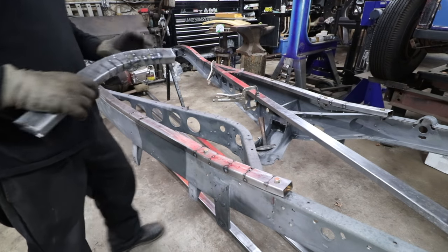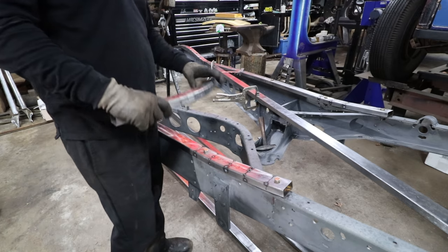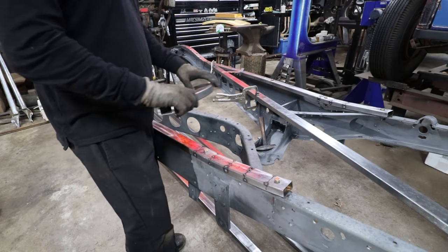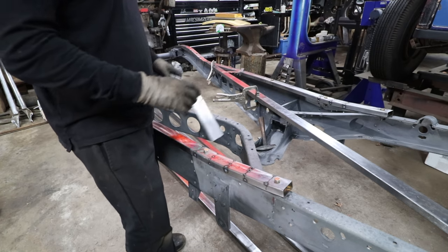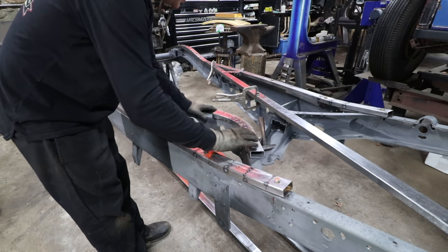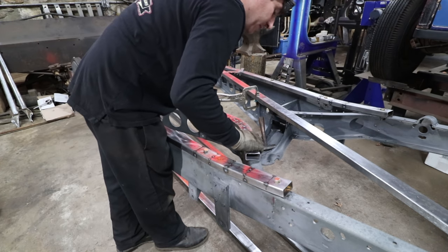So this time around, I made a little pattern. This is a pretty heavy bend here. And again, reminder, I don't have a hydraulic tubing bender that fits rectangular tubing, so we're doing this bare bones, basic way with what we got. I basically took the short piece to figure out how many cuts needed to be made and where, and I got this piece fitting pretty good.